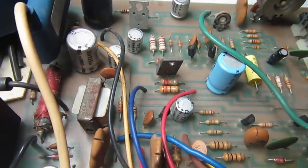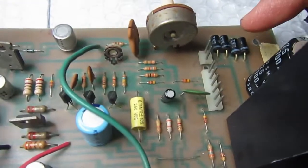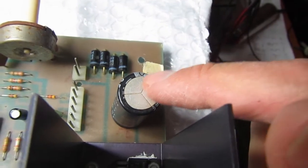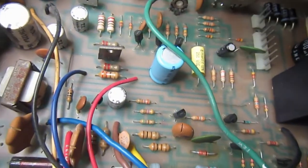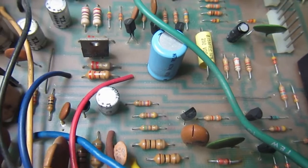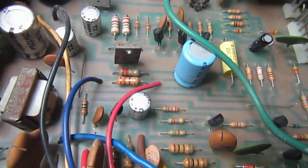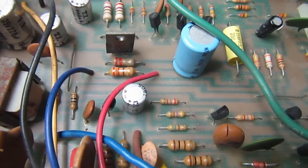Actually I cheated a bit, because before even trying to plug something in, I know it doesn't work. I just checked every semiconductor, checked the ESR of the electrolytics, and replaced this one because it was showing no capacitance and very high ESR. Every semiconductor looks good on a DC test with the multimeter — I mean transistors, diodes and so on. So it's something more complex than that. I also checked the soldering on the other side of the board; it's not very good but it looks like they made contact, so that's not something that simple either.